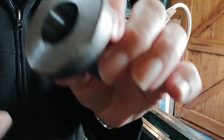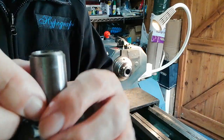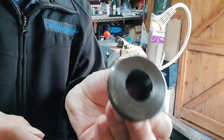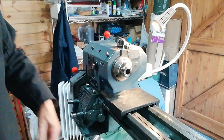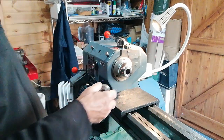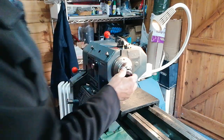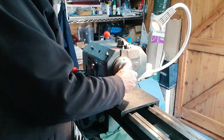The collet mount needs to be perfectly clean, especially on those surfaces inside, because the accuracy of the collet will depend on the cleanliness you apply. Any bits could throw the collet out. It's perfectly clean now, so we're going to introduce it to the spindle — I'll just remove any perspiration from that — and that's it, all you need to do.